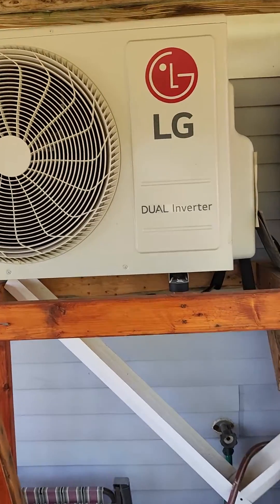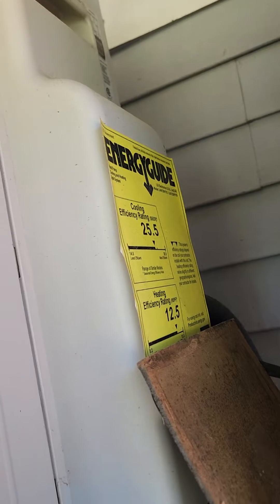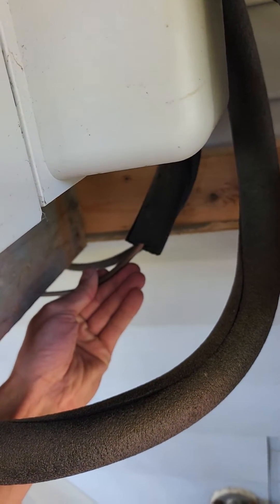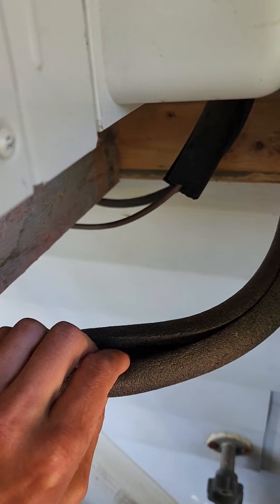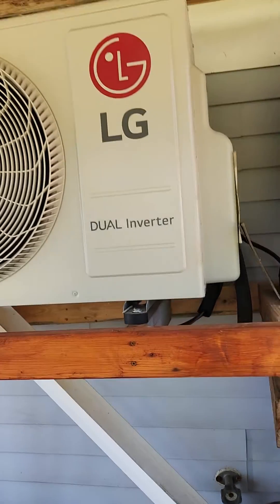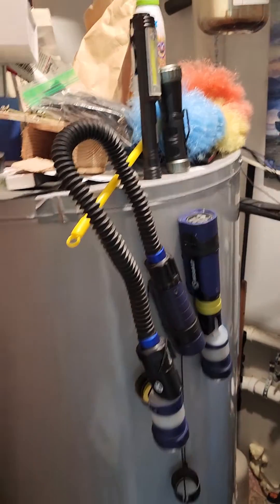This is a one-year update on the heat pump water heater. It's on right now — it's very hot outside so the fan doesn't have to spin fast, but you can hear the compressor definitely buzzing. That's the return line, maybe around 100 to 105 degrees, and then the supply — you don't even want to touch it — probably close to 140. Seems to be working just fine.